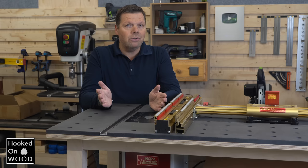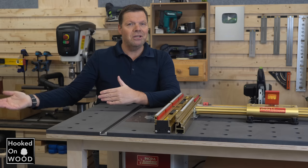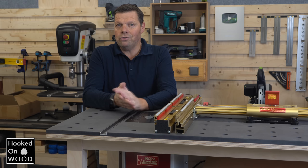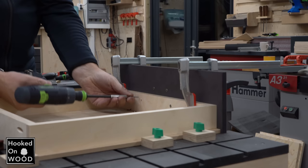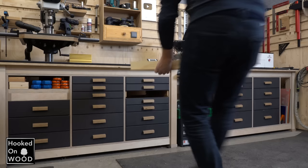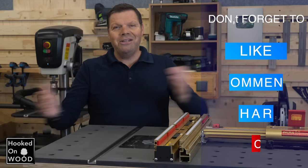So there are a lot of advantages to this drawer system. First, it saves a lot of money on sliders and expensive hardware because MDF is much more affordable. By keeping the size of the drawers low, you will also save on this — and I do not think you should stack products on each other in drawers. If you have to, just create another drawer and place it there. With this system, you have that flexibility. When you make the side panels accurate, you do not have to align both sides anymore, and all the drawers will be perfectly straight. This system will also save a lot of time because you can make a small series of drawers that with a simple template will fit without adjustment. And the last advantage is the flexibility this system gives you in the future — I started with mostly 14 cm drawers but discovered that the 7 cm size fits me better, and I was able to adapt over time.